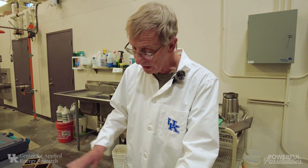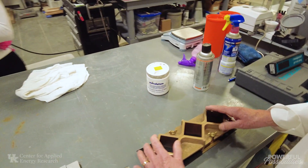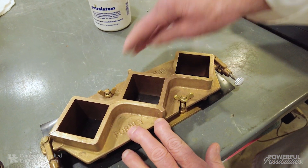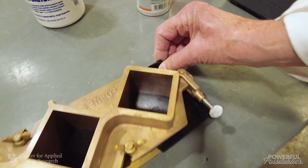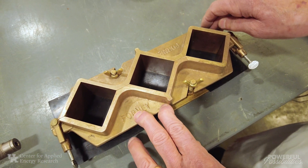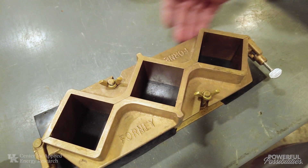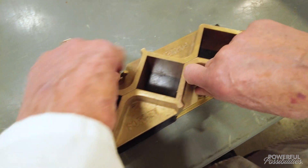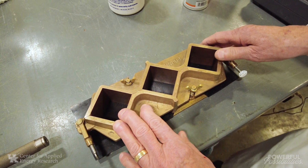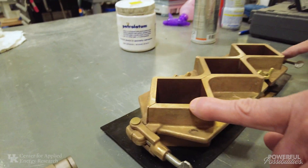This is the way we prepare things at the center. This is your conventional mold, gasketed with an eighth-inch thick butyl gasket at durometer 60 — a real stiff rubber to keep it from cupping. This helps with some of your older molds, because as you tighten them down, they develop a kind of curvature. So this prevents leakage. As the mold gets older, you'll see some of the paste beginning to leak out, and that's a good way of fixing it.